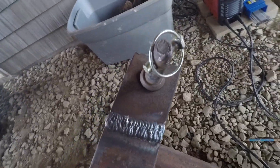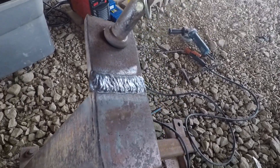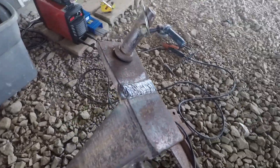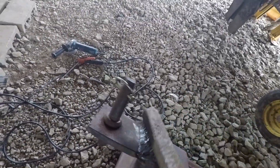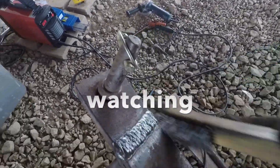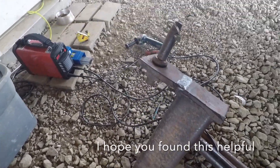There's no undercut, and that's a nice looking bead right there. I know it's not a pipeline. I thought it wouldn't hurt to put on a little weave there. I may do another video running on 220 and see how that goes. Technically a good grind flush, but there's no need to.